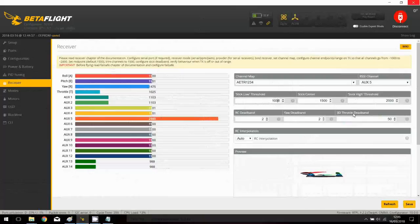Okay, and no problem. We have some dead band directly applied. That's great. Okay, and let's check that everything is at least something about 1990. So I am close to 2000. Okay, so it should not be so bad. I will save that, okay, and if you have a Taranis, probably you will need to change the throttle channel mapping, but here, since I use a Jumper, no real problem out of the box.